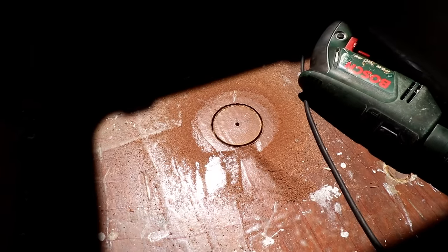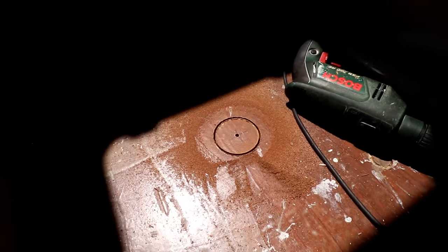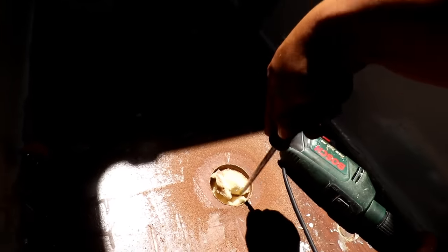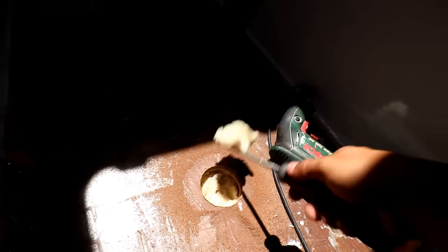The floor is covered in peel ply. As you can see, there's the hole drilled through, and there's epoxy — that's why there's peel ply. And there's the foam core that we put in. We'll dig all of this out, and before we put the post in, we'll seal it up nicely. That's quite tough because we bought a really high density one.